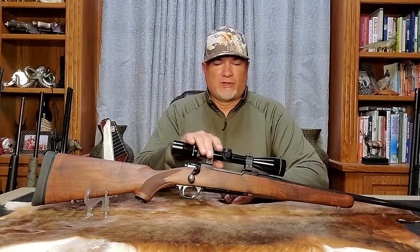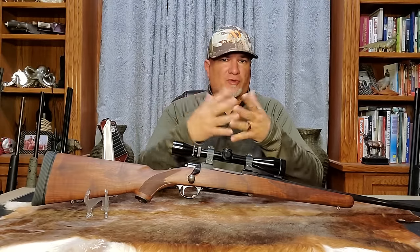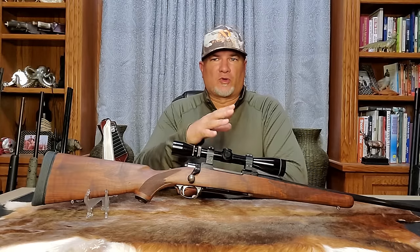Jim Sullivan's rifle design was completed and in production in three years. This original design was actually a push feed action — these were not controlled round feed rifles originally, like a lot of people think. They had a closed bolt face, which required the extractor to pop in place over the cartridge to chamber a round. It also had a plunger-style ejector instead of the Mauser-style fixed ejector. The safety is a two-position tang safety, and it had an angled front action screw that was pretty unique at the time. In later years, the M77 would be improved with the Mark II and the Hawkeye rifles. In this video, we'll explore the history of one of America's most iconic hunting rifles, the Ruger M77.